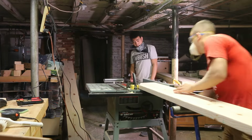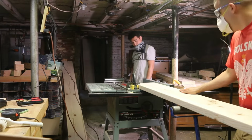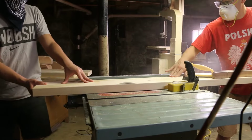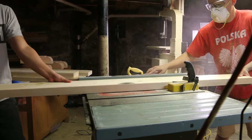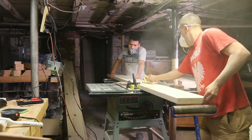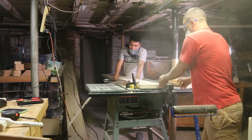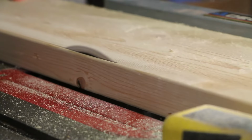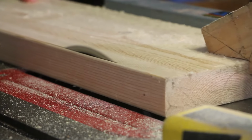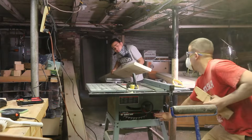We ripped a 1/4 inch off of all the interior edges of the boards for the table and bench top so that they would fit together flushly and seamlessly. I also really like to use a magnetic featherboard to hold the board in place during the cut. When ripping long boards like these, it's much safer and more accurate if you use two people and a roller support to help guide you. Push the board through at a consistent speed and push it flat against the table. Then just repeat this process for all the boards on the tabletop and the bench tops.